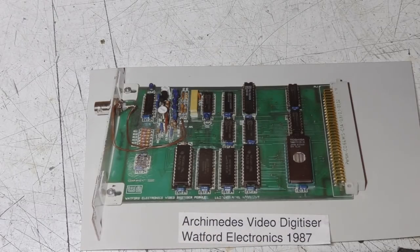They all had very subtle differences in their timings and protocols, and I have a feeling one of them, possibly the Mitsubishi, wouldn't actually do the data in. Obviously these were typically used for video display applications where the RAM data would be shifted into the shift register and then shifted out at video rates. So I was actually using it the other way around, and I think at least one of those chips didn't even support reading data in through the shift register.